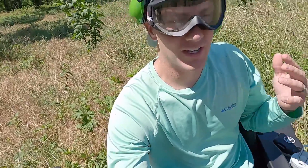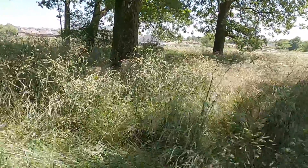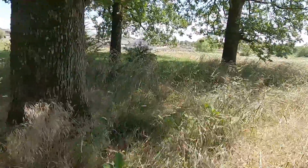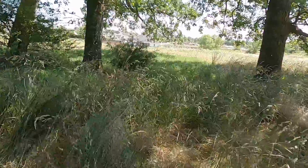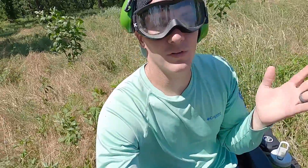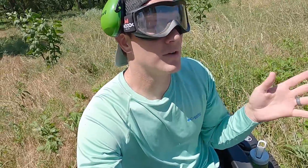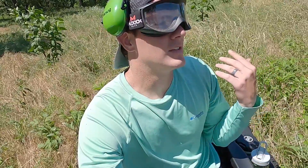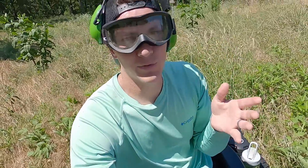That's just the nature of mowing really tall grass — the tall grass will lay over when the deck hits it, lays it down, and cuts it only a little bit at a time, so you have to go over it. If you come back in a different direction it'll cut easier. It's kind of a pain. I realize a brush hog would have been a better tool, but the equipment you have is more effective than the stuff you wish you had, 100% of the time.